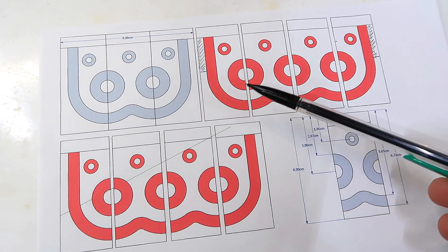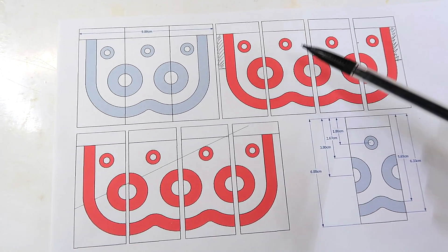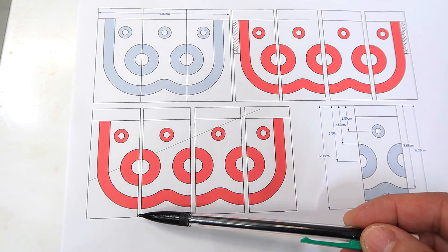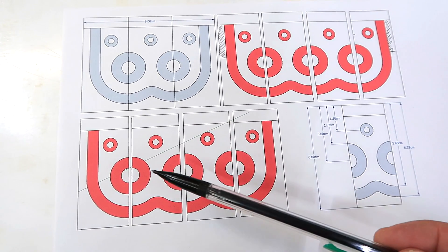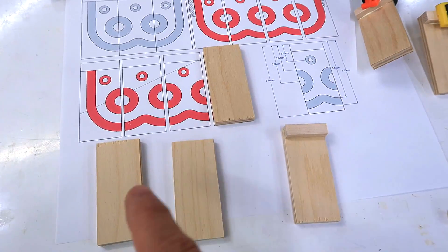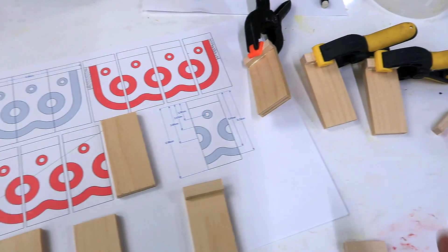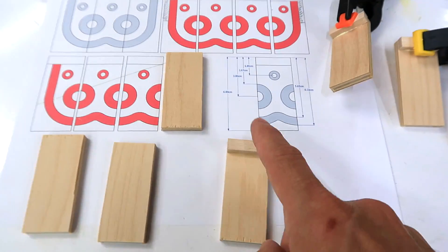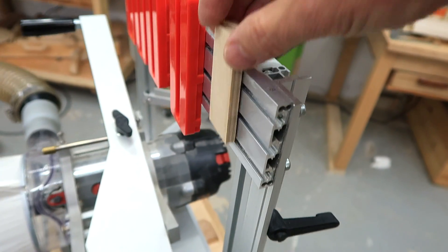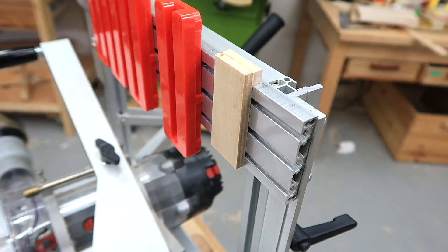I spent a bunch of time on Google SketchUp coming up with this template and I decided the best place to split the segments is right through the middle of the pin — that way the ends are simpler and I can just add more middle pieces to add more pins. I'm just going to make these to try them out. I just cut out a bunch of blanks for the templates and I'm gluing these little tabs to the top, which will allow me to hook this over the template holder to get a vertical position reference.